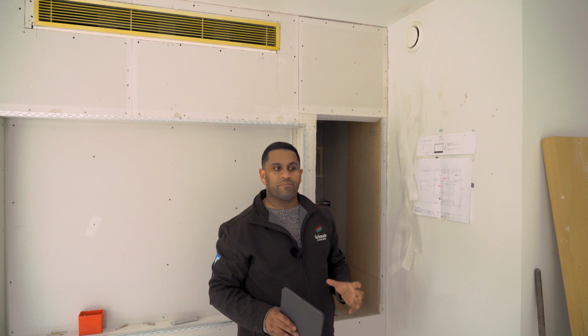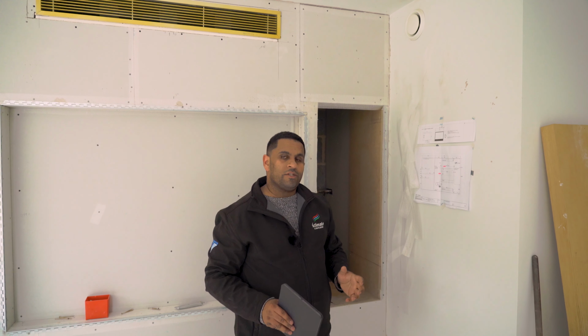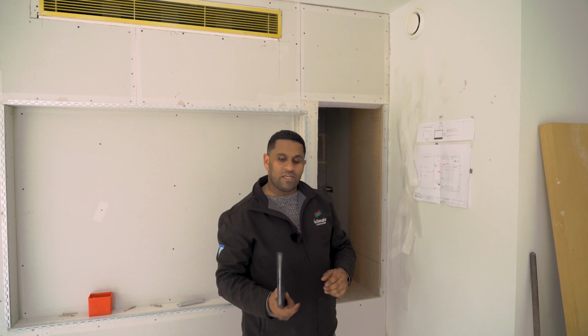This central system is a bespoke one-off unit. It actually heats up the hot water tanks as well. So it provides auxiliary heating for these space areas. It also gives hot water, and it does that through a heat recovery process, which I'll show you how it works. And it also does that through a refrigeration plant that's built in within the unit.